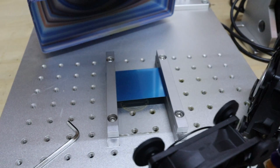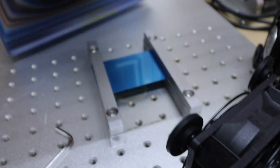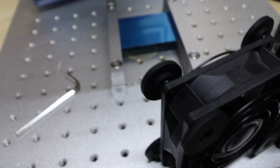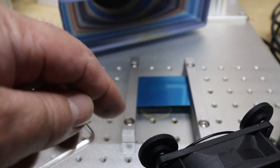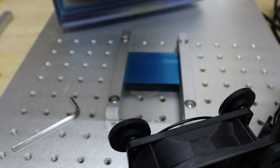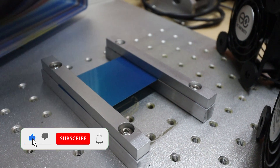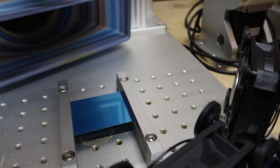Now those bolts that are in there are just for show — mine are too short, they don't grab, so I need to order some longer bolts off Amazon. But that's basically how it would work. When you cut, you obviously don't want to burn your bed underneath — I would lay at least a piece of scrap metal in that slot or area so you don't burn and mark it up. That's basically what we got: two of them together. It sandwiches whatever you put in there — just need longer bolts to squeeze it together.